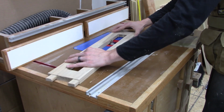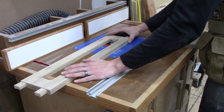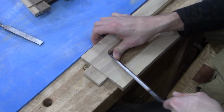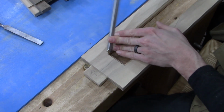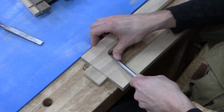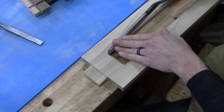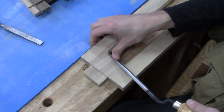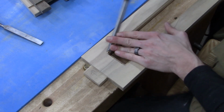And then I'm applying a chamfer to the inside and outside of these recesses in the aprons, just to change the look a little bit. And then after I do the routing, of course there's a rounded corner here due to the round bit, so coming back with a paring chisel and just working my way slowly into the corner. Some of these went really easy, just maybe 2 or 3 attempts with the chisel. Some of them took a little bit longer.